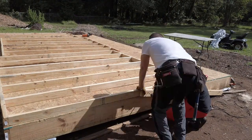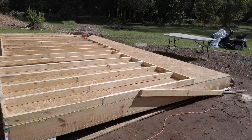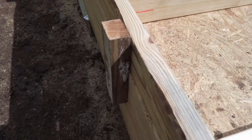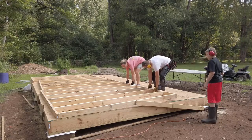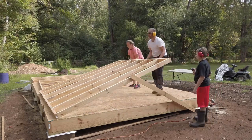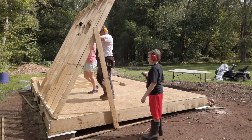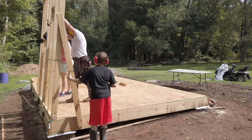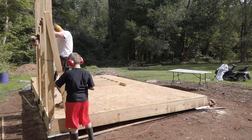This is a 20-foot wall. I'm not even going to try and lift this all at once, and I'm not going to sheathe it and lift it all at once. I don't have a crew of five men to help me out here. So I'm going to lift this in 8-foot sections with a 4-foot section at the end. Safety over all else. An 8-foot section can be lifted by one person without much of an issue, but if you have the help, by all means use it. Those stop blocks I placed help to flush the wall up with the floor framing as well — dual purpose.